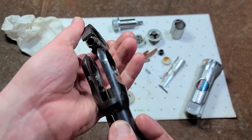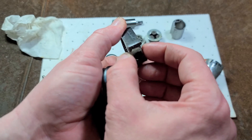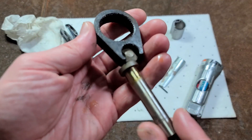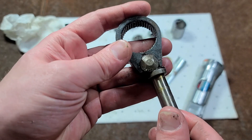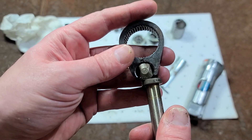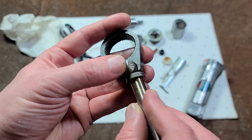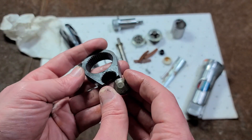If you do have any trouble getting the head off, here's the little mechanism — this is sliding back and forth against the drive post. This is really where the rubber meets the road. The drive post is just going back and forth cranking it one way, then the other. This is an area where the air tool oil only makes it through the motor, so you've got to make sure you lubricate this part too. Some complicated parts in here — lots of fine machining.